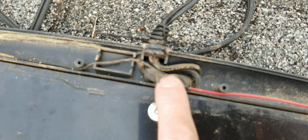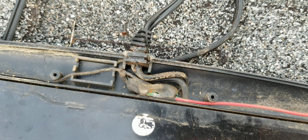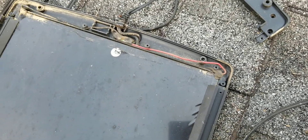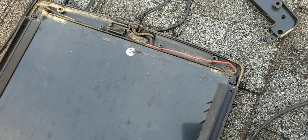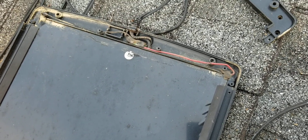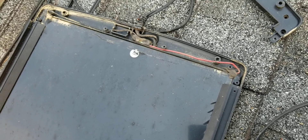In here you would have a diode and a resistor. I haven't seen those things burn out — it's been five years. Commonly the wires just break. So you'd look in there for any issues: there's one resistor, one diode — see if they're burnt. You can replace them if they are, but I haven't seen any on any of my panels, just broken wires.